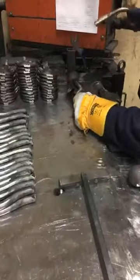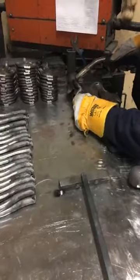Chop these down to about 8 and a half inch, take them off the bench. Got a lot of these here — put them in this jig onto a 50mm ball so it's nice and central, tacking up. Get the helmet on and weld these up.